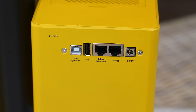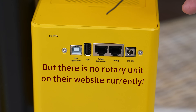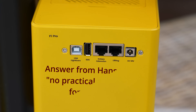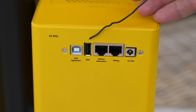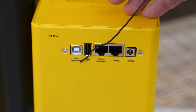These are the plugs on the back side: input for DC power, a lifting connector for the Z axis, rotary extension — I don't have that unit but you can connect a rotary unit to engrave cylindrical objects. There is also an SDS port and I don't know exactly what it is because there is no information in the user manual. Maybe it's for firmware updates or offline mode, but I don't think so since it would have been mentioned.